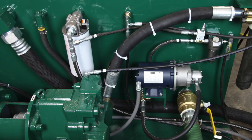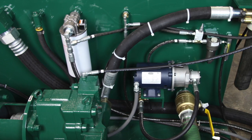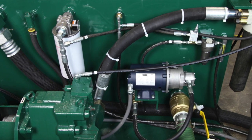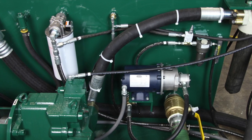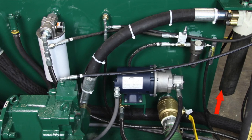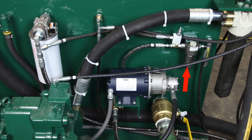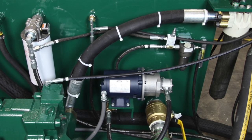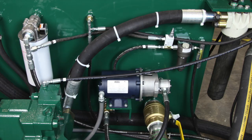This section of the video manual covers maintenance of the WTC 385 track press. It's important to keep the hydraulic system clean, as dirt causes serious and expensive damage to hydraulic equipment. Change the track press's filters regularly — a good plan is to schedule a filter change once every six months. The hydraulic power unit has three filters: the return filter, which uses a spin-on element; the large pressure filter, which uses a replacement element; and the small pressure filter, which uses a replacement element. Change a filter when the gauge goes to red on the return filter, or when the indicator pops up on the main pressure filter. If you change one filter, change all three. Please refer to your owner's manual for filter part numbers.